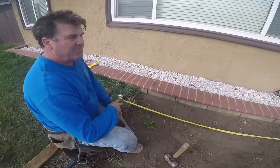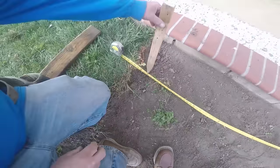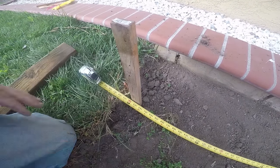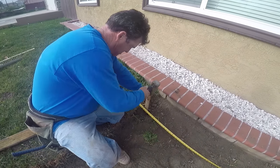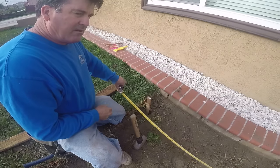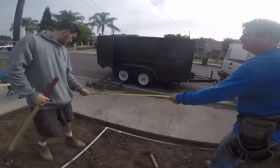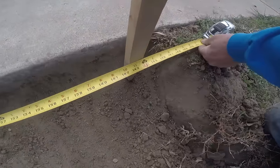Take a look over here — here's 12 feet. That's going to be the inside edge of the form, so the stake has to be to the inside of everything. This side of the stake comes down right at 12, so my line will tie here, my form will be here, and nothing will touch that line. So now we have the stake in at 12 feet. We'll do the other side the same way, trying to hold this against that concrete on the inside edge. That's the setup you want right there.